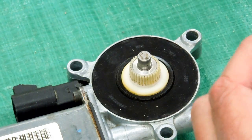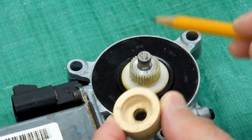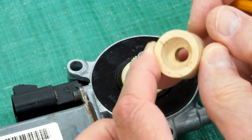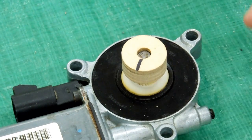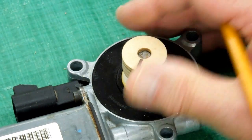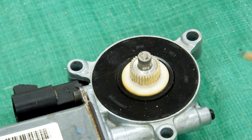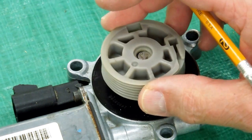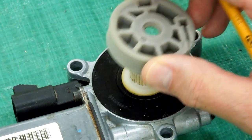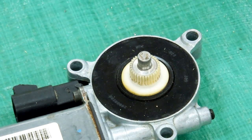This will work. If you take the time to put a slight taper on this to match the taper on the splines, add a little epoxy, push that down on there, and when it's cured out you may have a little difficulty getting it off, but it will work. When you're at the auto salvage yard and you find this, take a little extra time to find the matching part from the regulator that goes on that spline. This is the cable winch drum for the regulator.